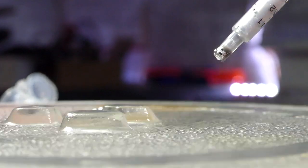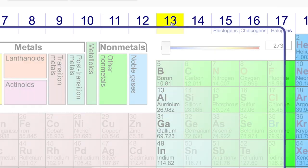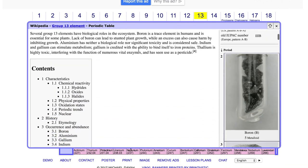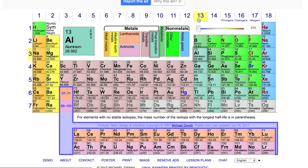That means it can literally melt in your hand, so it's super easy to cast and mold. Liquid metal — cool name for a band. As I said, gallium has the same number of valence electrons as aluminum, so they're in the same group and can actually form an alloy. Aluminum has a much higher melting point and is used in all sorts of stuff because it's lightweight, cheap, and strong. But if we bring it in contact with gallium, the two metals will react forming an aluminum-gallium alloy, making it much more brittle. So think of this as the aluminum melter. I'm going to test this on some locks and handcuffs to see if this is a viable thing that spies should be carrying. Whatever you learn in this video, don't use it for anything illegal — hashtag don't demonetize.